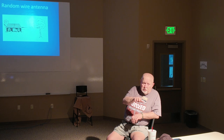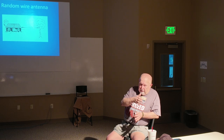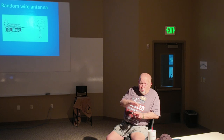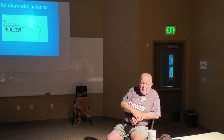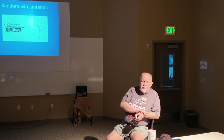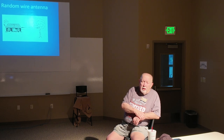Okay, do you understand what I'm saying? Right. Well, let me ask. Say 80 meters is the lowest you're going to transmit. A quarter wave wire on 80 meters is approximately 62 feet. Now, because the slinky is a spiral, would you be measuring the distance of the spiral, or the actual distance of the length? I'm sorry, I didn't understand the slinky part. Stretch it out as far as you can.